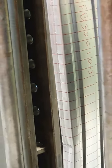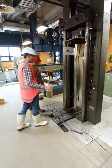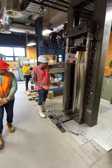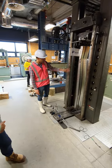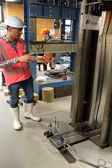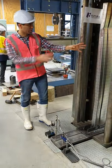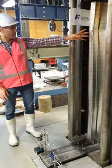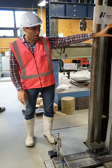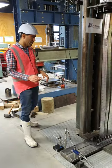This proves that we have a very good and reliable boxed section. As you can see here at Futura, we have developed this innovative system, which is slightly different to conventional cold-formed steel sections, which are typically C or Z sections. This is acting as a boxed section, and we've achieved quite a bit higher capacity than typical cold-formed steel sections.